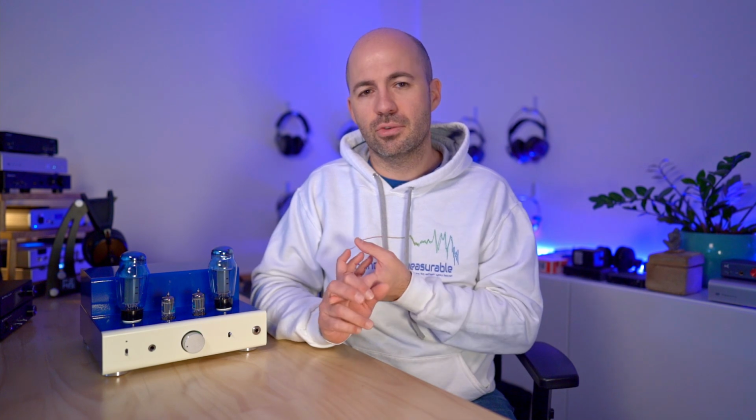Something that I didn't cover off in part 1 because it really relates to sound quality, so I'm covering it now, is that the 8200R also has the ability to work in multiple modes. The 8200R can work as an ultralinear amplifier, as a pentode style amplifier, or as a triode style amplifier, and it all comes down to how it's driving the tubes. It's designed specifically as an ultralinear amplifier, but it does allow you, as I said, to try the other modes. So of course I did.